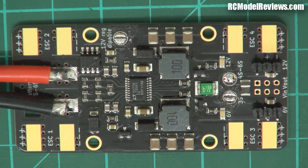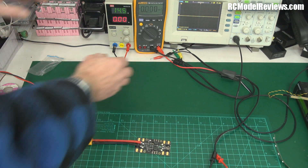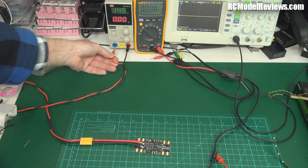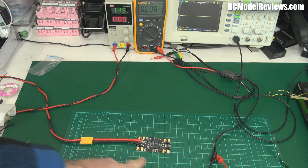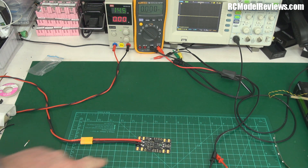There's a lot right with this and not a lot wrong with it, and for the price — I couldn't get over it. The US list price is about 45 bucks, which is pretty damn good for all the goodies on there. I also tested reversing the leads on the input and no smoke came out — it still worked afterwards. Let me do the unthinkable: it's plugged in, LEDs are on, I'll unplug it and plug the wires in the other way around on my bench supply — black to positive and red to negative. Look at that! No smoke. The reverse polarity protection does stop it going up in smoke, though as I said, if you've got ESCs on there, the magic smoke will still come out of those.